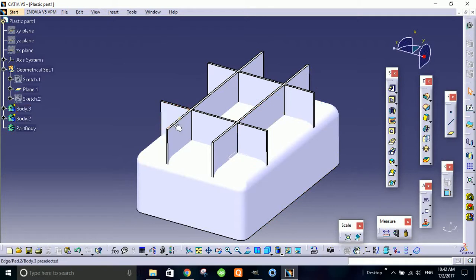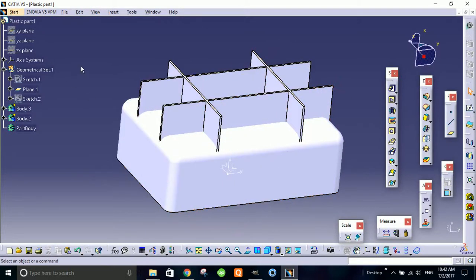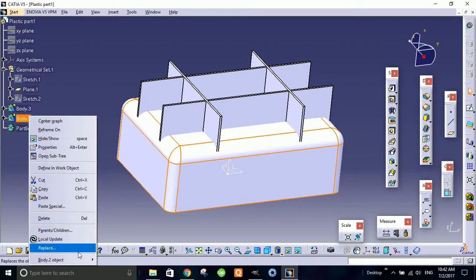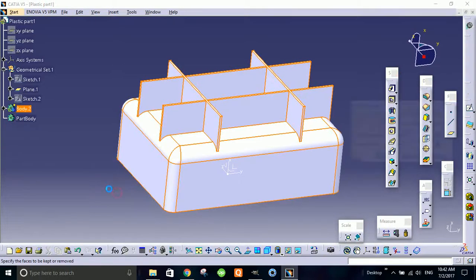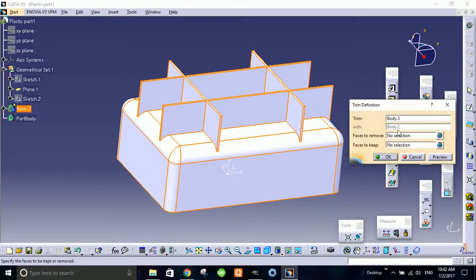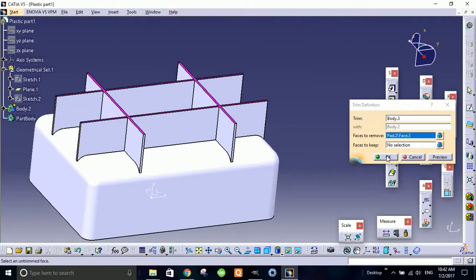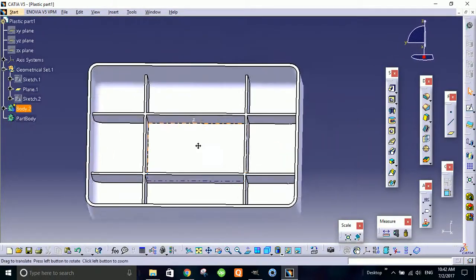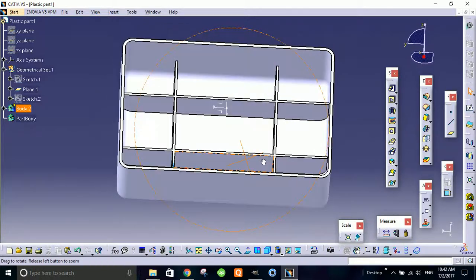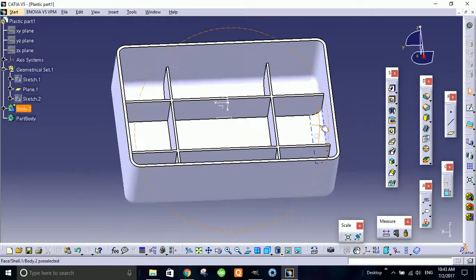Now I have to remove this particular material which is coming outside from the surface. For that, in CATIA V5 we have Boolean operations. Using Boolean operations, you can do that very easily. This is Union Trim. Union Trim, trim body 3 with body 2, face to remove, I'll select this face to be removed. Okay. So you can see that we are in our desired situation. So do some practice. Watch the video again and again. Have some idea. See you soon.